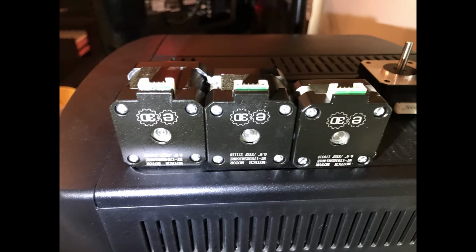As for the biggest motor here, the Axis motor, I wanted to replace the motor on my Z-axis for a while. The X carriage is too heavy, which means the motor gets way too hot and tends to skip steps. Even though I have the VREF on my TMC2100s turned quite high, it still skips steps and gets hot, which means that the motor isn't powerful enough. So I wanted to replace that, and that's my replacement.